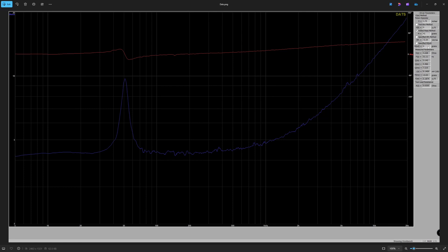Looking at some of the TS parameters, we see a slight dip in loudness from 75 down to 73 decibels at 1 watt 1 meter. This is likely due to the moving mass, as version 17's was 8 grams and 17.1 is up at 13 grams — about 60% heavier. The FS has dropped from 93 to 51 hertz as well, meaning this speaker is better suited to lower frequencies. This can be a product of heavier cone suspensions, as more weight reduces the FS.